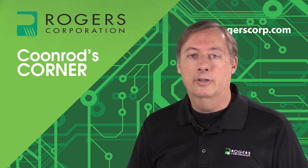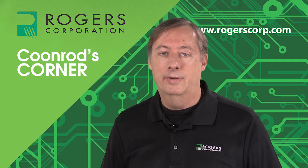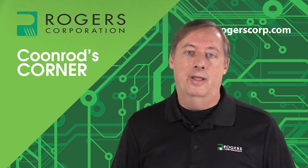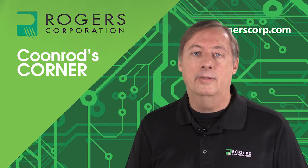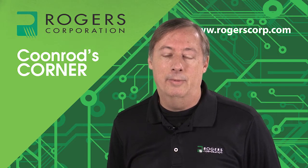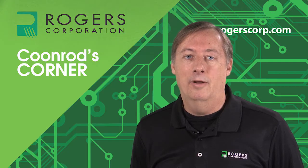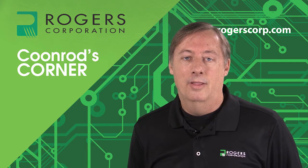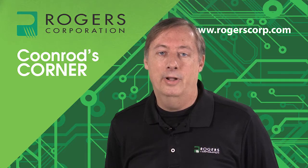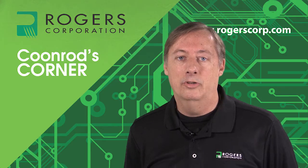There are several things the RF designer needs to consider for these prepregs at millimeter wave frequencies — defined as roughly 30 GHz to 300 GHz. One category is printed circuit board fabrication. On the PCB fab side, you want a prepreg with properties that are easy to process. The most important process in circuit fabrication for prepreg or bond ply is lamination. Assuming a material capable of standard processing at most circuit fabricators, that's good for yields. Those parameters are usually around 350°F to 400°F for cure temperature, and pressures around 200 to 400 PSI — pretty common for most prepregs and bond plies used in the PCB industry.